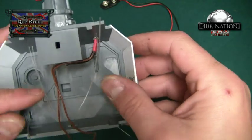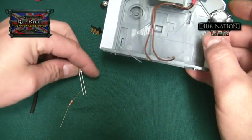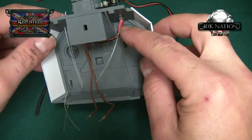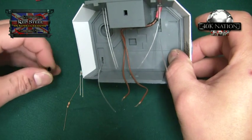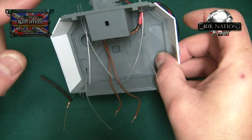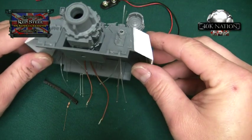I'm going to go off camera now. I'm going to join them all together. I'm going to solder the resistor to the LED, just like this one here. The only difference is this is going to be an exposed light. The LED in here will just have the light in the heat shrink with the fibre optics. We'll see how it goes. Back in a sec.